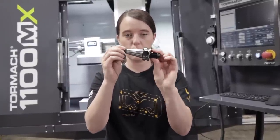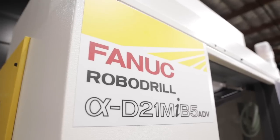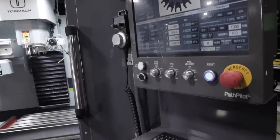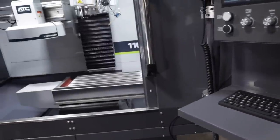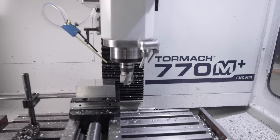To recap, the big key differences between the 770M Plus and the 1100MX — the major thing is going to be that spindle. It's going to be that BT30 tool holder: more rigidity, more availability, you can do rigid tapping. This tool holder is actually compatible with our RoboDrill, which is another cool fact. And then also you have that extra half horsepower, which does make a big difference. And then your table travel. You might decide to go with the 1100MX over the 770M Plus, assuming that you have the power requirements in order to do it. On the other hand, you have the 770M Plus, which is going to be the more cost-friendly option — and you can literally plug it in anywhere. You can plug it in in the kitchen next to your toaster and make toast and parts at the same time.